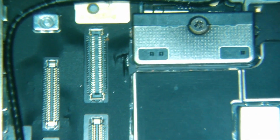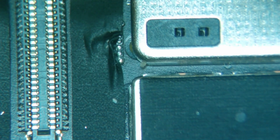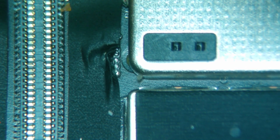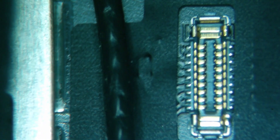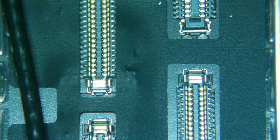I was just about to isolate the battery myself, and then I took a closer look. You'll see right over here we've actually got what looks like a resistor hanging out next to the battery connector, and then we've got some pads here that something's been torn off of. I think we might have got a little rough — probably prying. I'm not sure how or why you would pry exactly at that spot; it's kind of unusual. You can see the impression from that capacitor there — hopefully that's nothing unusual, because sometimes the pressure from the sticker will do that, but this is definitely going to be an issue.